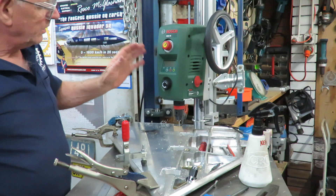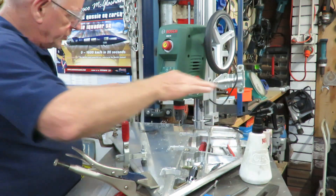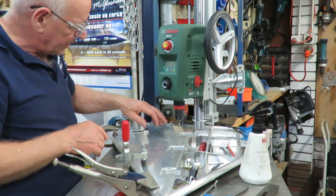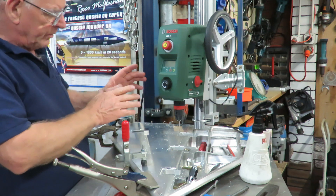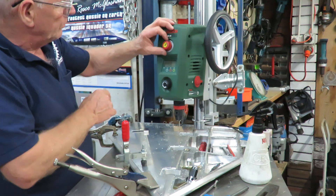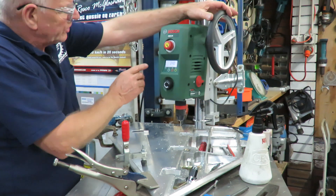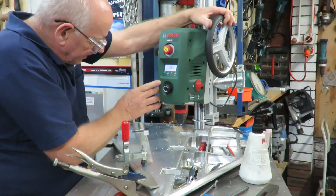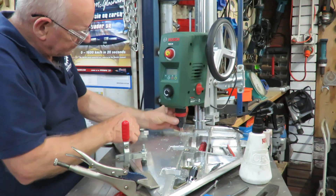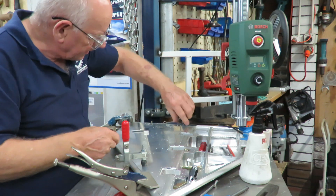This drill has many features on it — it's quite something. It's a little hobbyist drill that I bought particularly for this job, and of course it's not on its normal base frame; it's been connected up to this apparatus I've built. So now I'm going to run that tap down a little bit — the main reason is so that I'm threading in the same plane as the actual work. I've got that at low speed going quite slow, and then I'll hit the stop button when she starts to labour. I'll just release that out, move it aside, and then do the rest of the job with the hand tap.